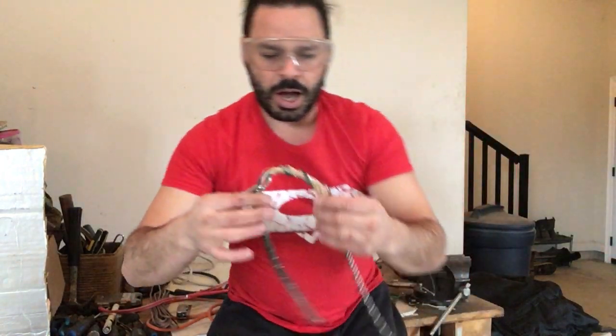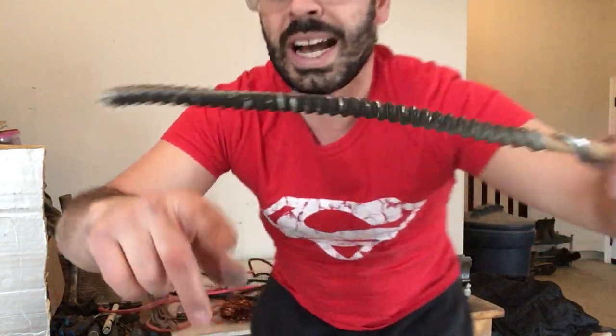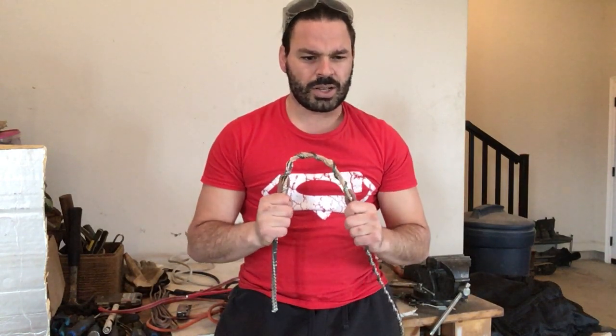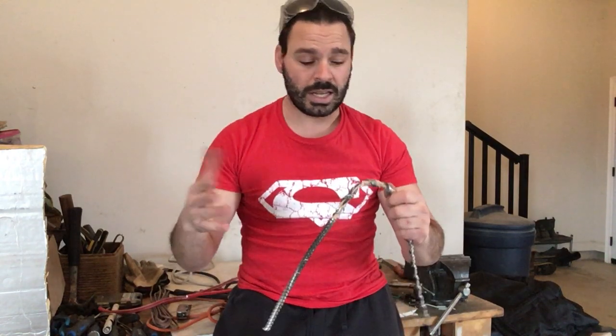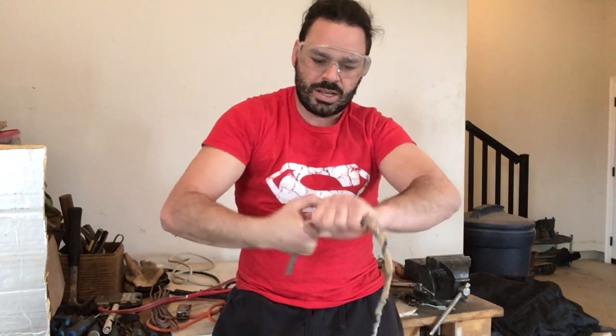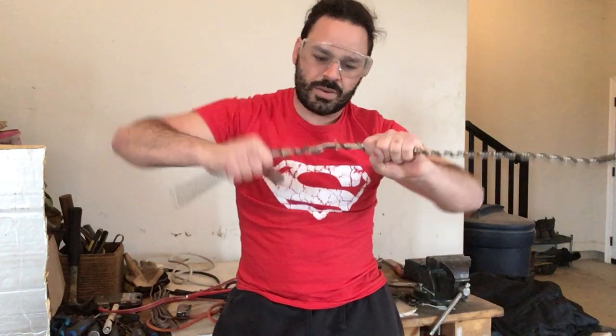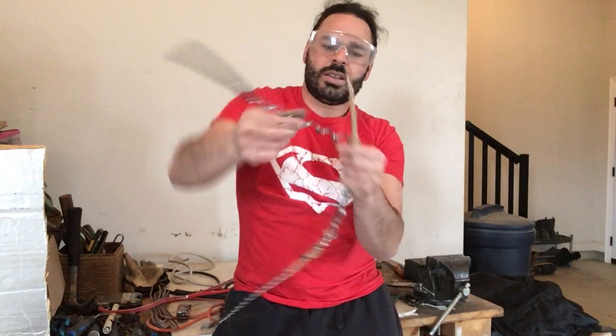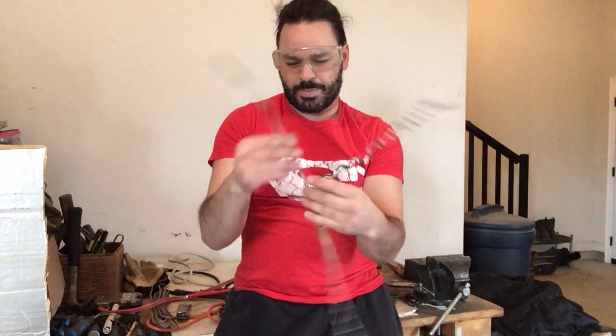Another subscriber actually asked about BX wire. BX wire is your household wire that has the aluminum coating on it, and it has inside a nice piece of clean copper. Currently, BX wire is going for $1.93, I think, a pound, which is great. But all I'm going to do just to get that copper out is make some twists in it and pull it. Okay, it starts coming out. Start to unravel it, and once I can unravel it enough, it starts to fold out, and inside you'll start seeing some nice clean copper and some wires. It also has a coating of paper on it. Again, you definitely want to make sure you wear safety glasses with this.